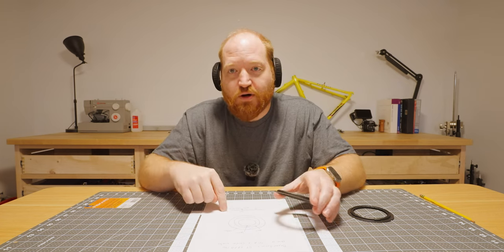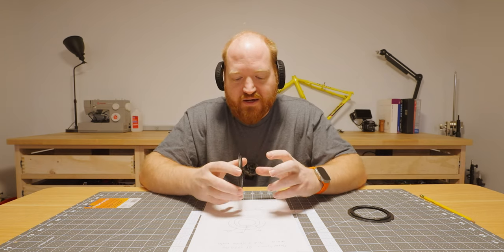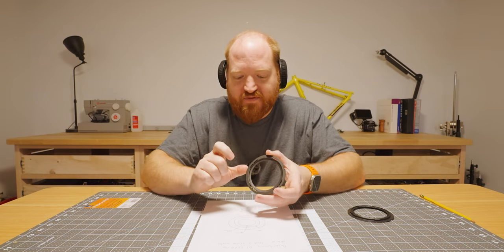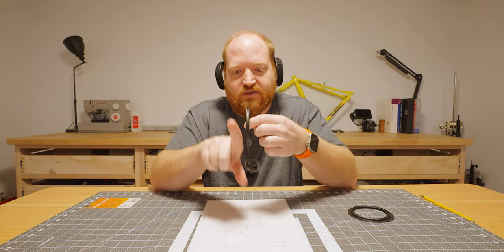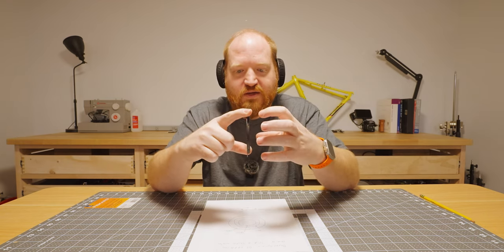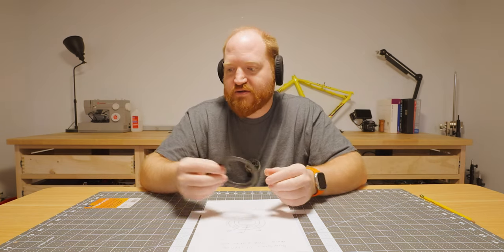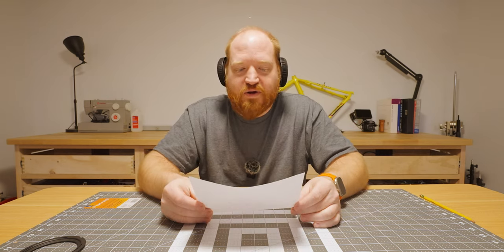And then I can use this drawing to come up with the rest of the design that go into the TMA-2s. His last note is that he thinks that these are a little bit too flat. So he would like to have like a 9 millimeter offset. So if you're looking at the plane, this is where the earmuffs mount. He wants the back of the adapter where it goes into the TMA-2s to be 9 millimeters offset, which I think I can handle that. So we will shift over to my computer and start modeling this up in Inventor.